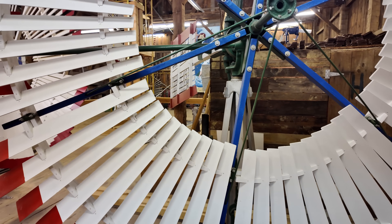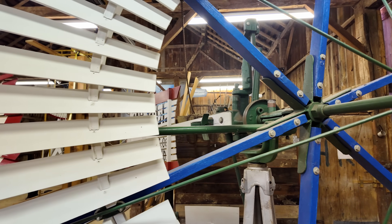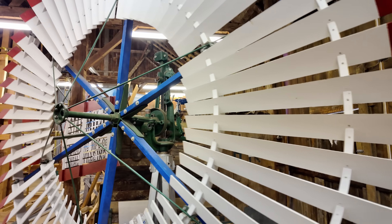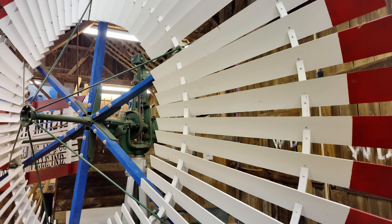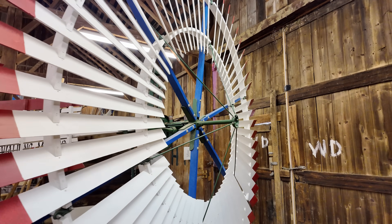To see that again: you have the green bar coming across here, it gets pushed back, the lever causes it to lift up, and that turns the windmill. So now, although your windmill's not turning anymore, it's also not tearing itself apart.